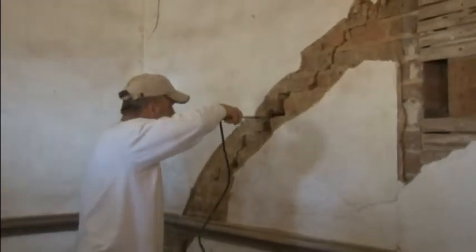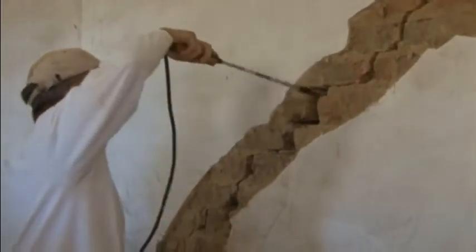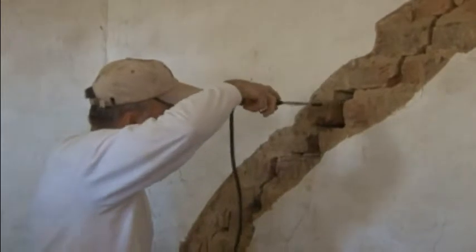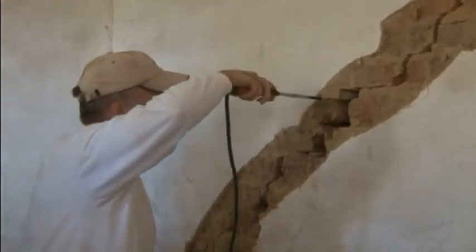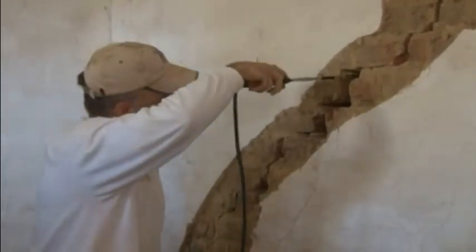Is that just water? Yes, that's just water. I'm applying this to help aid the absorption, because the minute the water hits the brick — it's so dry — it'll absorb that moisture real fast, and that'll sort of slow everything down.